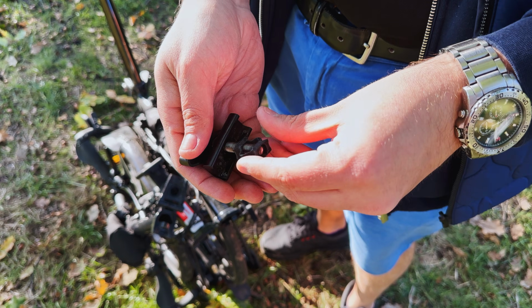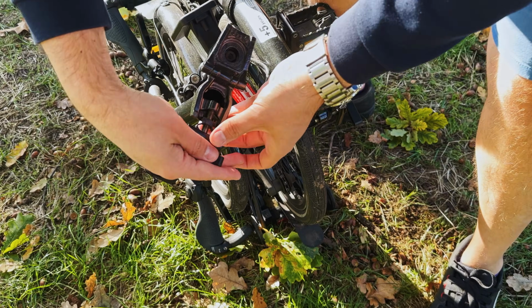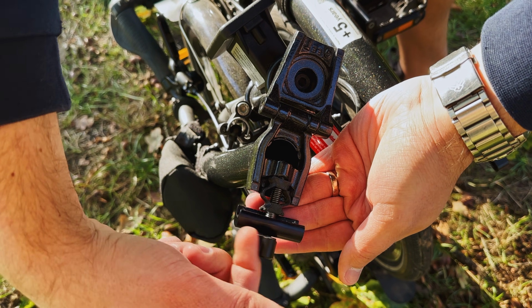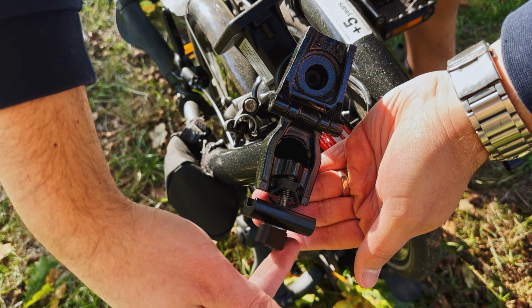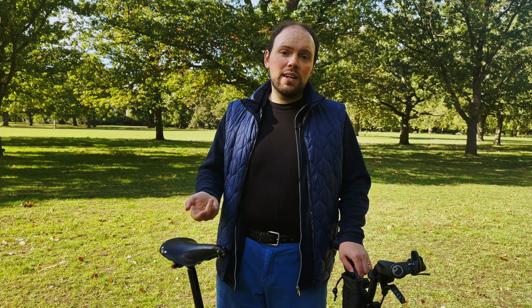Now when you put it on top of your hinge bolt and inside a hinge plate, it stops it from rotating vertically and maintains its horizontal alignment, which is everything that you need to deal with this problem. I think this is an absolutely amazing product. It's quite cheap, weighs less than a gram, very durable as it's made from polyurethane plastic, easy to install, you basically just place it and forget it.